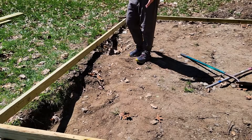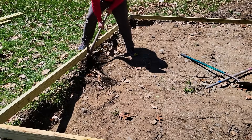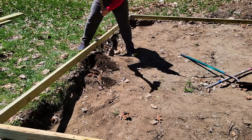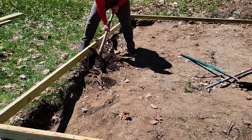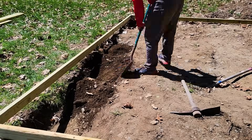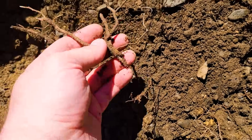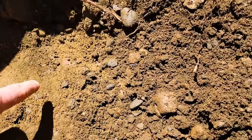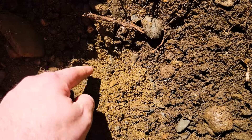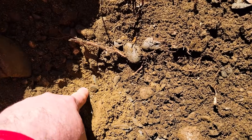I need to dig that out. Now I live in New England - there's a lot of rocks - so we typically need to break it apart. There's some topsoil on here, and although I'm not going below the frost line in this case, I do need to be below the topsoil. The organic matter will decay and settle, so I want to be below that. We're starting to break through - this stuff here is organic material, roots and things. Now we broke through it right here, the color changed, and now this is sandy gravel. That stuff is good to put a foundation on, but the organic dark material is not.